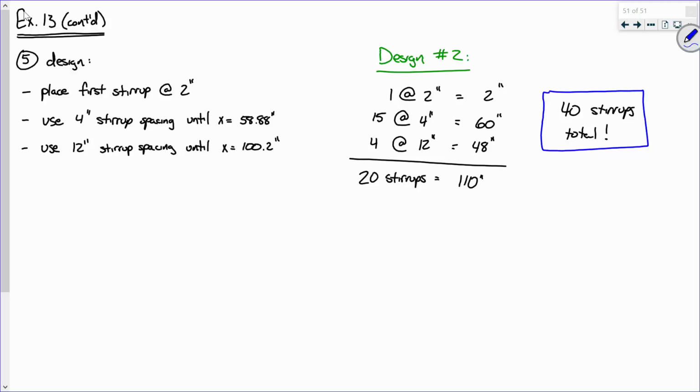Spoken like a true engineer. I like it. Any questions? Everybody with me so far? Now, let's also be clear, we've really only used 2 stirrup spacings. We've used the 4 inches, which was essentially the minimum. How did we get that 4 inches? That 4 inches was derived by computing what we absolutely need at the region of the highest shear. That's the minimum. The maximum is 12.